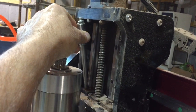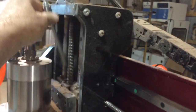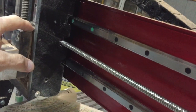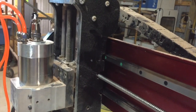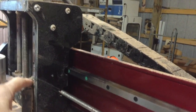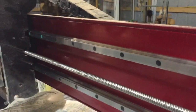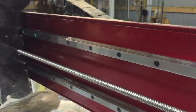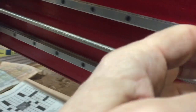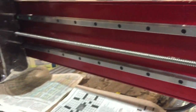Any section not yet wiped down should be cleaned before greasing — same procedure: vacuum, wipe down, clean it up, then grease it. You'll be good for another 30 to 40 hours. If you neglect this, the bearings will seize, ruining your project and the bearings themselves. You'd have to disassemble the entire machine — the carriages slide off, the bearings are exposed, and the side rails come off the end.